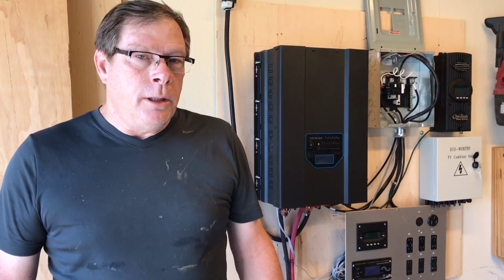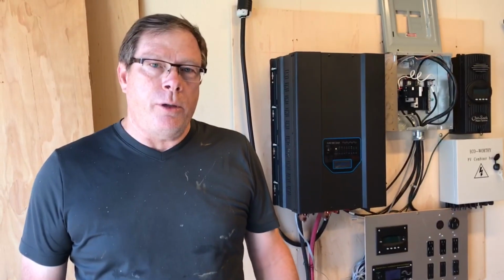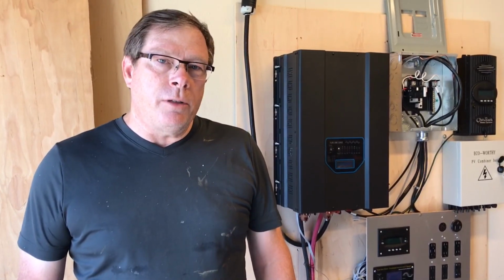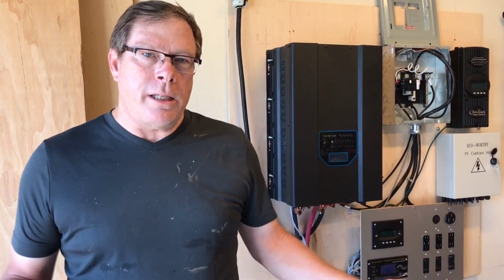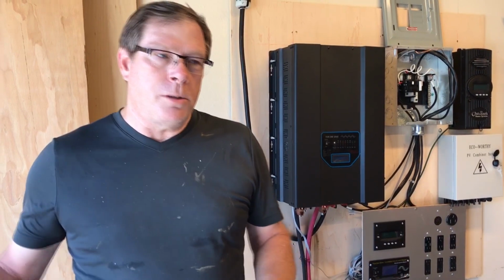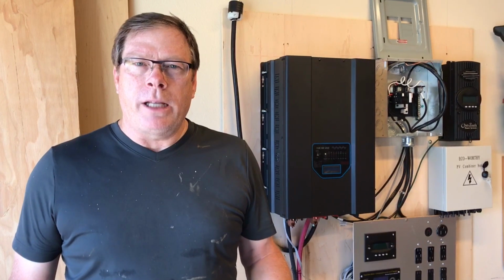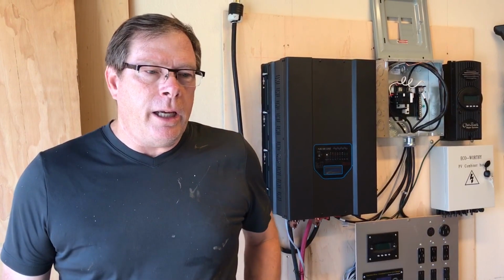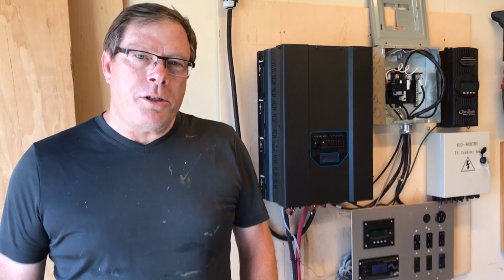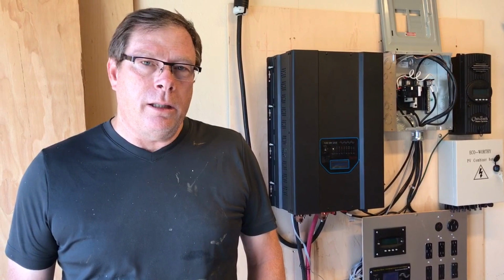I first considered going with a 24 volt system, fewer batteries, and a smaller inverter in a mobile cart that would be motorized with a DC motor, also powered by the 24 volts, so I can move it around because the batteries are very heavy. Sort of along the line of what you might see if you search the internet for a VSP 14,000, only larger. And then I realized that a 24 volt inverter, to give me the wattage that I wanted, was just going to be more expensive and heavier than I imagined.